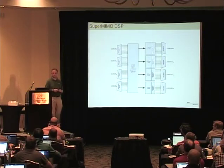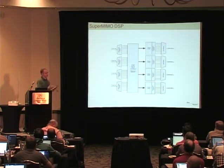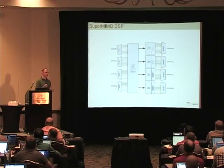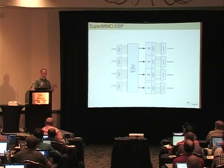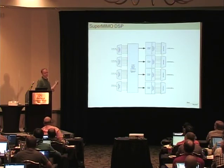The current USRPs will get you 50 megahertz of RF bandwidth at 8-bit samples, or 25 megahertz at 16-bit samples — not quite as wide an IF, but that kind of frequency coverage. You'll also be able to transmit with USRPs; the QR210 is receive-only. The B250 that we talked about yesterday enables an even denser system — it gives you 80 megahertz of RF bandwidth and two-way in the box, so you'd get four antennas per rack unit, the same as the Quad Radio 210. It won't have quite the same dynamic range and phase noise performance as the QR210, but it'll get you the same antenna density.